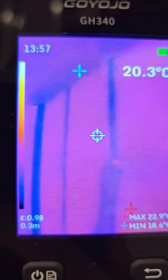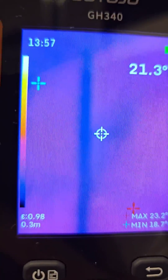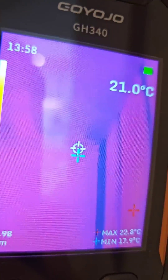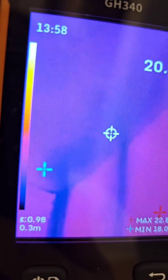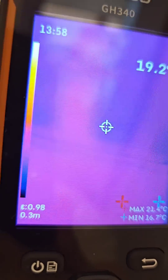There's something that might be useful for some of you guys doing home inspections. You can see the walls here — there are a couple of areas that are colder. They sound like maybe they're panels, and maybe there's wood or joints behind them. Near the window you can see there's a bit of a cold patch in the corner. Normally when it's an obvious darker cold patch, it could indicate a leak of some sort.